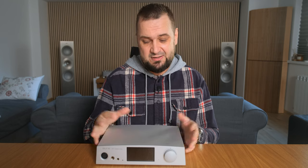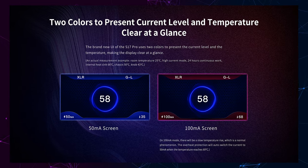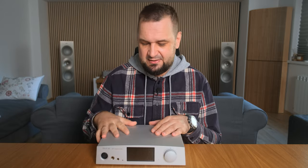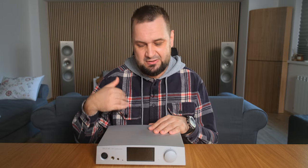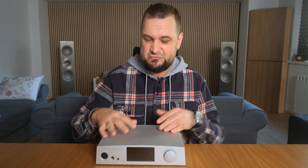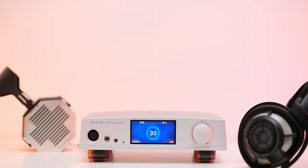Mind you, that's at 32 ohms — not 16 ohms, as many headphone amp makers try to trick you with. This one also provides almost one watt of power at 300 ohms, which is honestly a lot. It boots in Class AB operation, but with a touch of a button you can switch to full Class A operation, which doubles the current output to your headphones. Output transistors heat up quite a lot versus Class AB, and if it reaches 69°C it automatically switches back to Class AB. In my office, which isn't very well ventilated, it never reached that temperature.